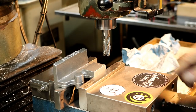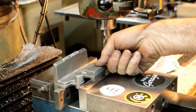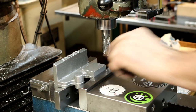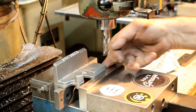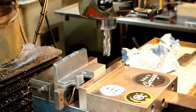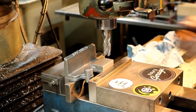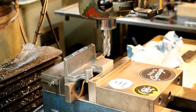And then we're going to mill this off to get this to the prescribed thickness, whatever that is. I'll go look at what that is. That's so much from the reference surface, so I'll have to be able to reach in there with a mic and measure that. So this thickness will be 600 thousandths, and we're about 648 right now.